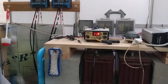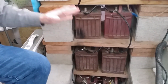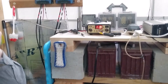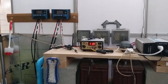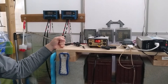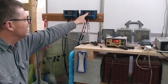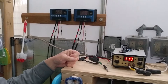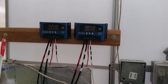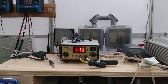We have all of these in parallel. So even though there are eight of them, we still have only a 12-volt system. But by doing this in parallel, you increase your amperage every time you add another battery or add more solar panels. We have a lot of amps coming in whenever we are really charging. Right now the sun's just barely shining outside, but we still have three-tenths of an amp coming in on this one array and one-tenth of an amp coming in on that one. And this only shows us our current battery bank voltage.